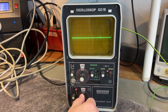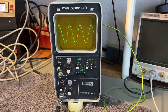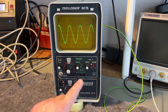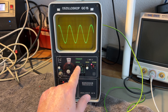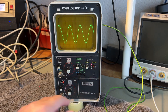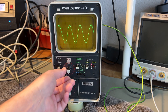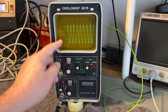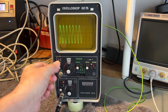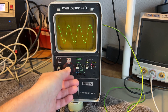Let's try and get some input signal and see if this is really alive. After a little bit of cleaning and fixing, it's now looking nice and shiny again. I also found a new little — I couldn't find the white one, this is light gray. I think this one is pretty good as well. This is 1 kilohertz and the time base is also correct. If I go to 1 millisecond per division and move this, it's also very close to 1 division — so it's probably pretty good.